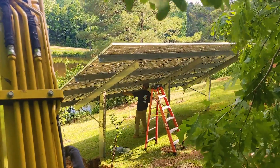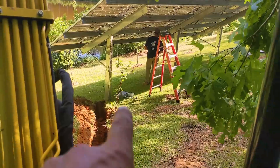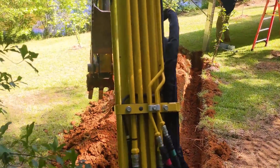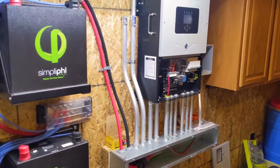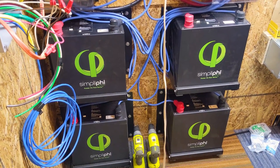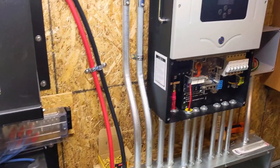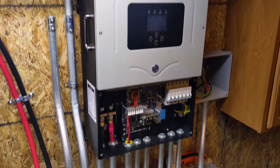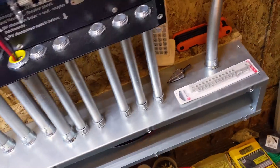We're wiring it in a way to mitigate the shading - that's what Abraham's working on. We'll probably put the combiners and branch connectors in the middle and run a home run over to a pre-built pull box. The customer's got everything in nice EMT with nice bends and kicks - he's doing a really good job. He watched all our videos and just started building.